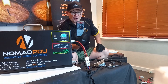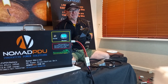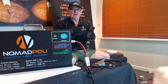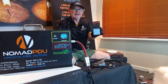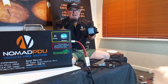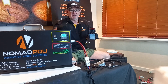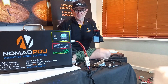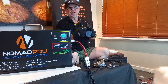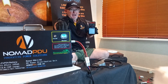If you leave these units without use for 3, 4, or 5 months, the best thing is to fully charge them again. They'll be in sleep mode and the calibration on the SOC screen will be a little out — that's normal because of the way it communicates between the app and the BMS, which is every 6 hours during sleep. So if left for 2 or 3 months, the battery will hold charge but the screen may get out of sync. Just fully charge it and wait until the screen stops pulsating.